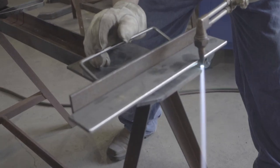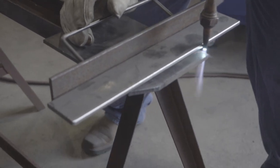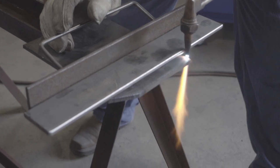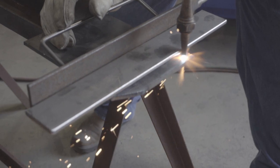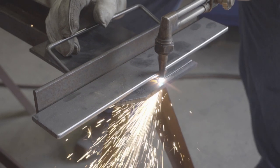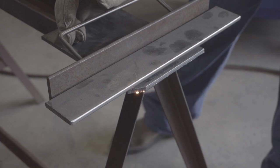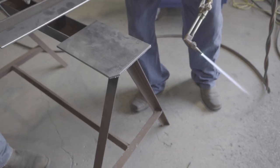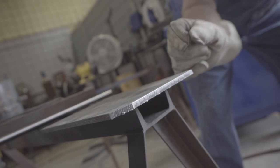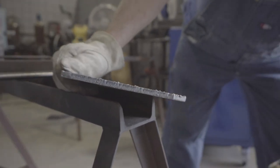So let's try this again. I want to use the burn bar as a straight edge, so I'm cutting one-handed — and that's why I lock my valves down here below. That rolled factory edge is a little easier to get into. If you hear a ripping and a snorting, that's a good thing. Very nice. I'm getting old and a little herky-jerky and you can see it in the lines. That's called the kerf — the width that's blown out of there is called the kerf. But you don't have to do a lot of cleaning — we can hit that with a grinder and a flapper disc and we're good to weld.